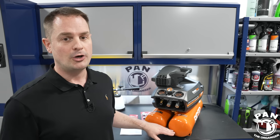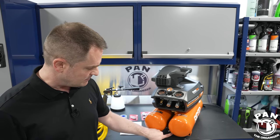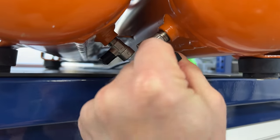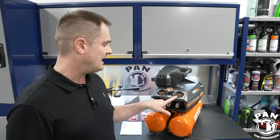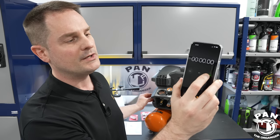When you're done using it, it's important to drain the tanks so no water or humidity accumulates and causes rust. There's a quarter-inch turn ball valve under each tank — simply turn the knob 90 degrees to release air and moisture, then close it. Now let's do the fill test. Both indicators are currently at zero PSI — I'll turn it on and time it on a stopwatch so you can see how long it takes to fully pressurize.